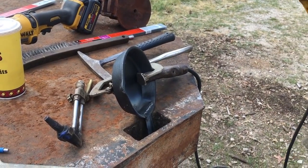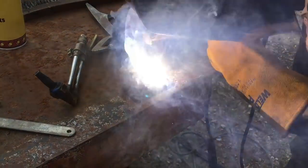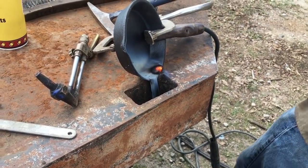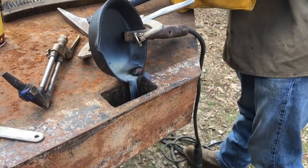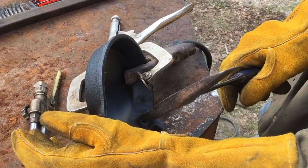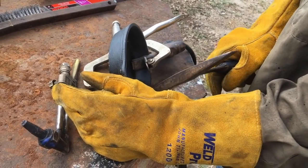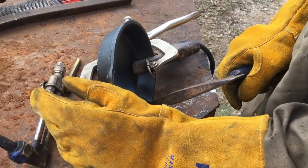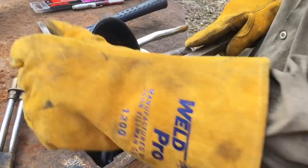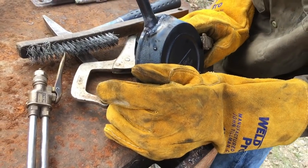Not be the blind man and try this again. Yeah. I got hot. And nickel doesn't like to weld over nickel. I did not mention about nickel, you cannot weld a layer of nickel down and then put another layer of nickel over top. That's why you keep nickel 55 or 99 in the truck with Nomacast. Nomacast first, then your nickel.